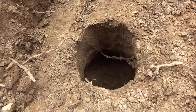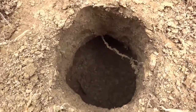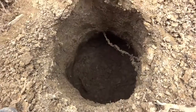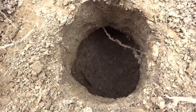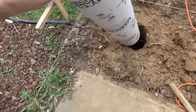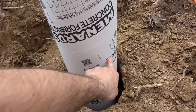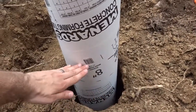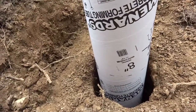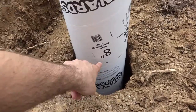I probably went a little overboard — this deck is probably a little over-built — but I saw a cool idea I wanted to try. In the hole I actually flared out the bottom like a bell, where it goes down and flares out. I'm going to make a wider concrete footing at the bottom. Here are the tubes I'm using: eight-inch diameter, four foot tall, and I have to cut them down. I drop it in the hole, measure from the string line down fifteen and a quarter inches — that's where the top of the concrete pier will be. I went an additional four inches deeper with a dashed line, and I'm going to cut the tube four inches shorter so it actually floats.